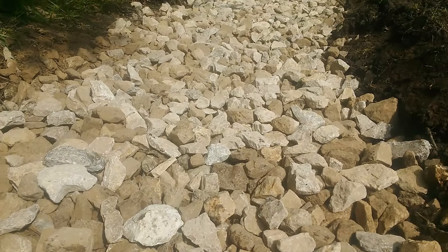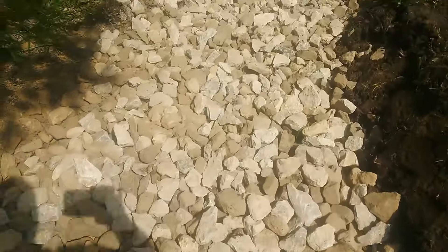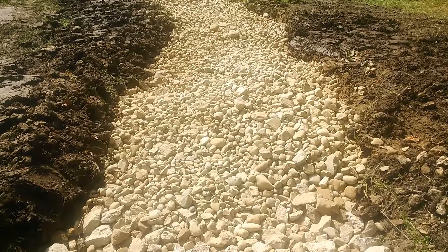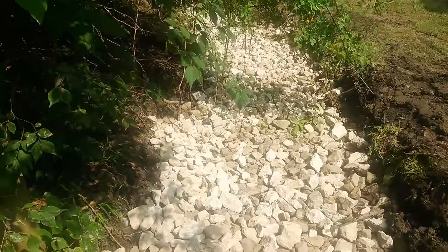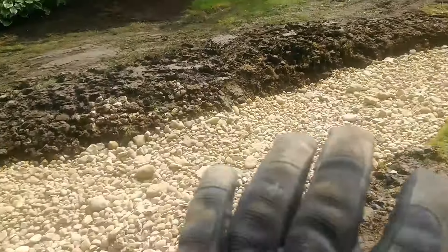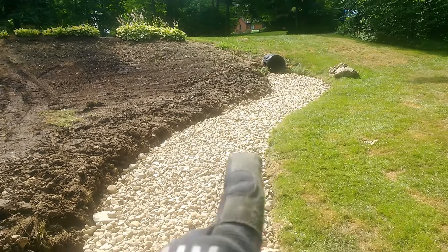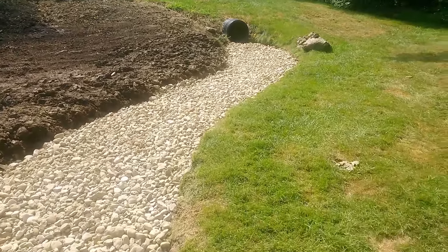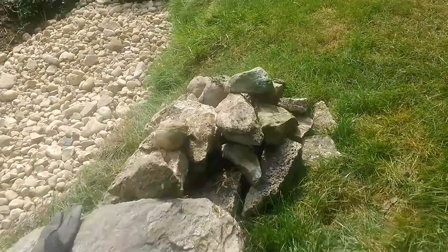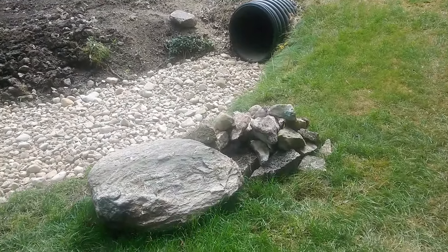Through the unfinished section you can see where the cobble stops and the crushed twos start. I've put two or three inches of crushed twos as a base layer because they're an angular crushed product. Given how hard it runs when it rains, my hope is that the crushed material holds the round cobbles in place — the crushed twos won't wash down as easily. I still recommend that, as an afterthought, boulders could be added around the edges especially where the water comes through the channel, to break the water flow and prevent washing.